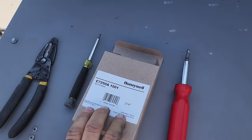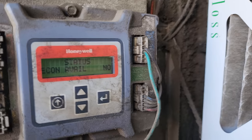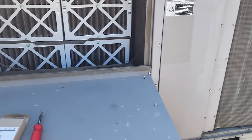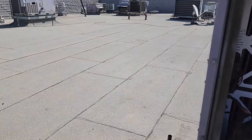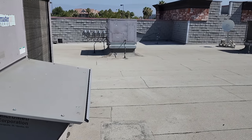I've got the new zone sensor installed. Now we're reading 78 degrees outside air, so this AC is done. I'm going to put it back together, button it up, and get the work order signed. We're still working on the kitchen AC — I've got someone doing that. I've got the compressor for this one, so we'll jump on that here in a minute.